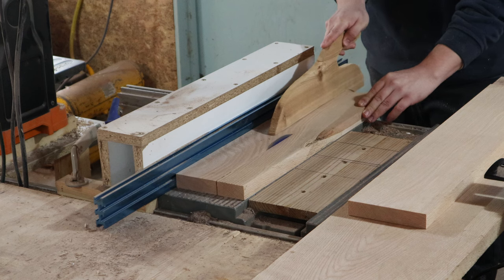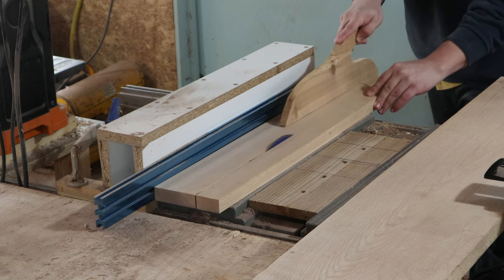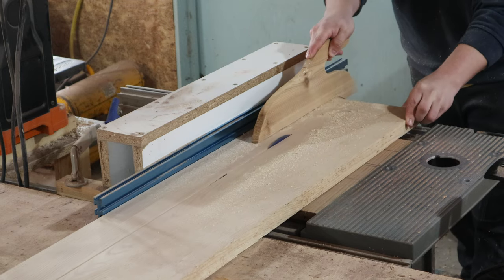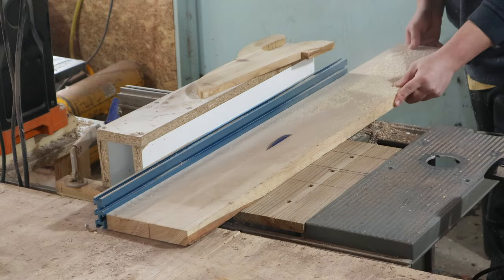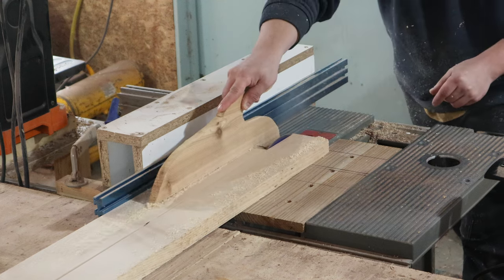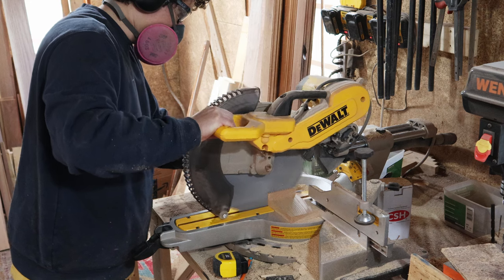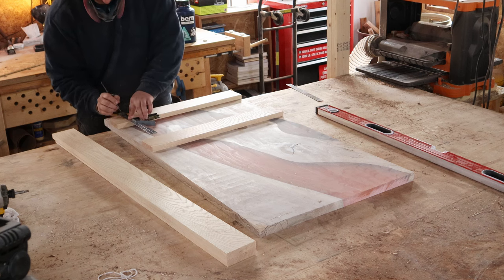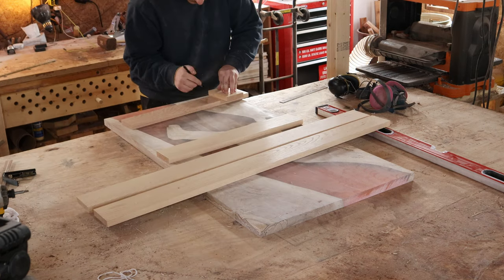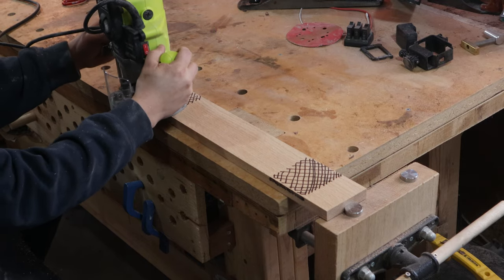So I set about milling some leftover red oak for my TV stand project that I completed over a year ago. For the top of the base, I used half lap joinery that I cut using my plunge router and a chisel.